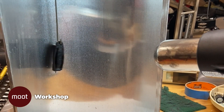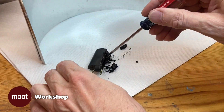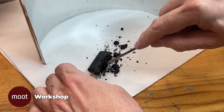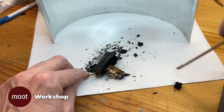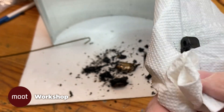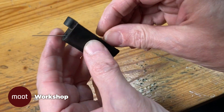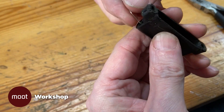With all those installed, I'm going to address that capacitor. First, I'm going to hit it with a heat gun to soften that pitch and dig the old capacitor out of the inside of that plastic case. This little guy is the modern equivalent of the capacitor that was in here, and it takes up just a fraction of the space.